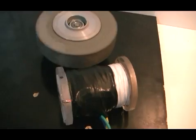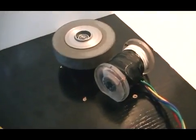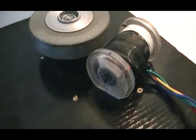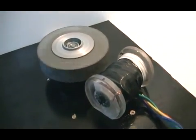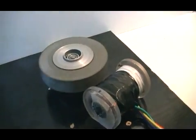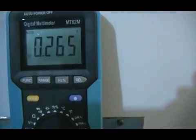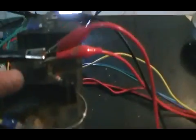It doesn't really matter which way you have the coil — it will work either like that or head-on. I think this way is more efficient, but that would also depend on the spacing of your magnets in the rotor. This rotor has a north-south configuration with eight magnets in total, drawing six volts from our power supply at 265 milliamps. That is going to the positive side of our three-phase cap. Pin here is the ground, common throughout the whole circuit, and pin three on our three-phase cap is collecting the back EMF.